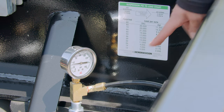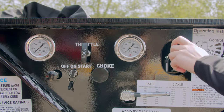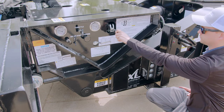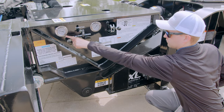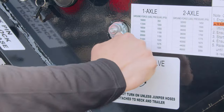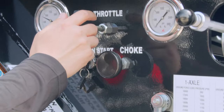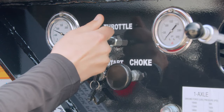The Power Booster axle ground forces should never exceed the main trailer axle ground forces. Now, move the control handle to the load position and hold it there until the desired hydraulic pressure is reached. Turn the ball valve handle to the closed position. The ball valve isolates the system to maintain ground force during transit. Turn the power unit off and close its fuel shutoff valve.